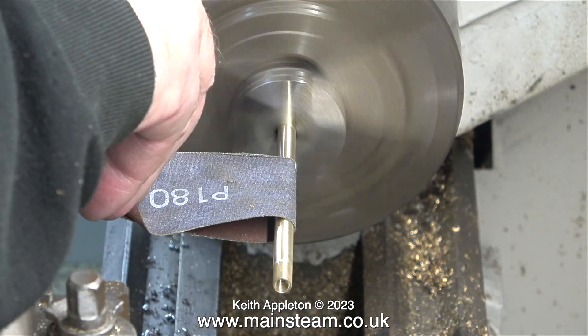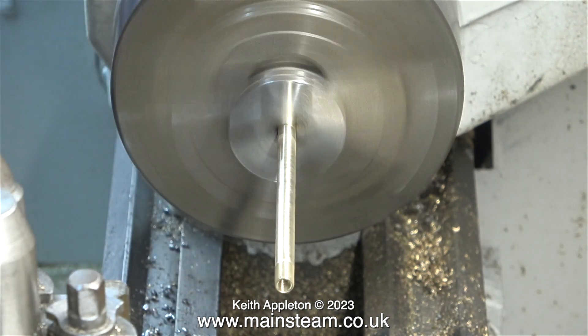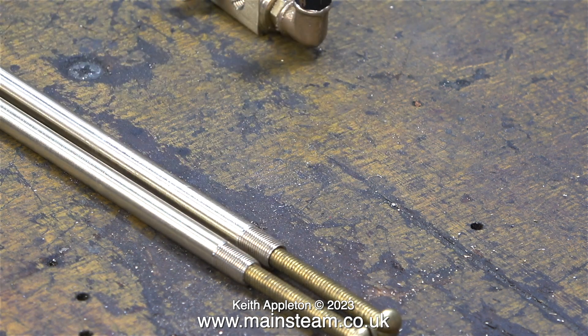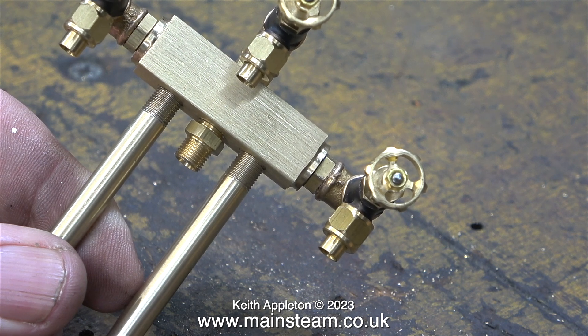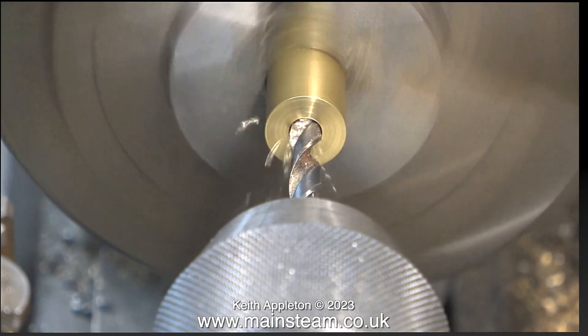Now it's time for a clean up of the two brass rods — first using a piece of 180 grit emery cloth, followed by some 400 grade wet-and-dry sandpaper. I don't want these columns to be polished, I just want them to be clean. I loosely fitted a couple of 2BA brass bolts with which I will fasten the completed turret to the baseboard. With both of the rods fully screwed into the turret, you can see at this end there's quite a lot of quarter by 40 thread showing.